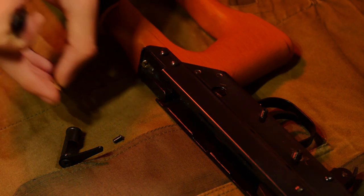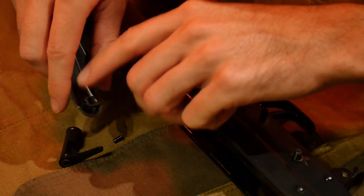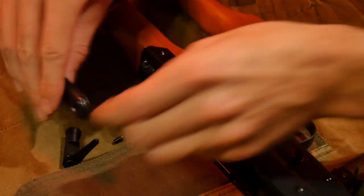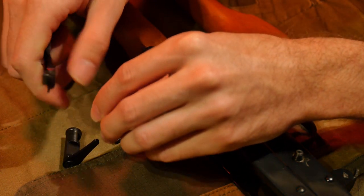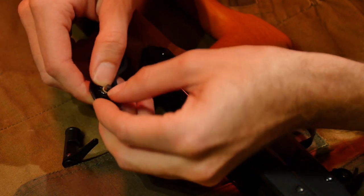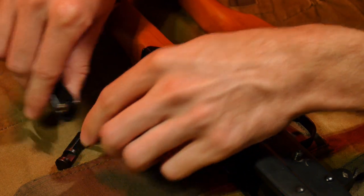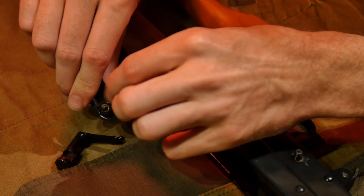For the LCT paddles, what will likely need to be modified is filing the two flats on the inside of the cam piece that comes with the LCT paddle. This is by design — the intention is that you wick these ever so slightly to get a nice snug fit, because any play on this short-throw 23-degree system is going to be extremely noticeable. You don't want that. The final thing to modify is the little brass bushing that comes with the kit — you will have to shorten it in length, because as assembled the brass protrudes past the face, meaning the paddle will never get fully tight with the 3Bar D Productions toggle cam. Just file about a 16th of an inch off the end of the bushing.